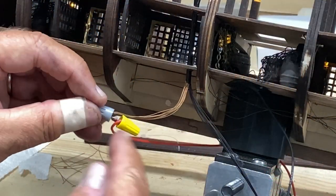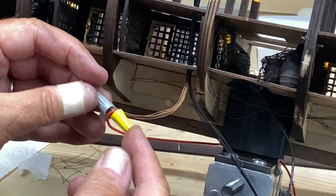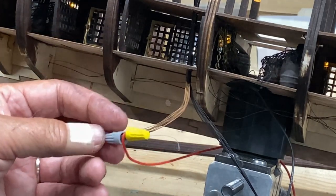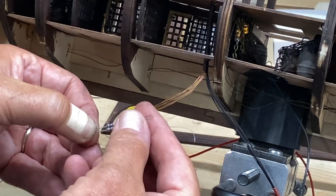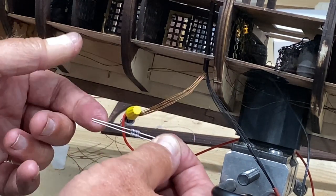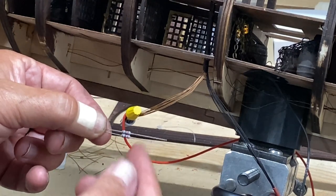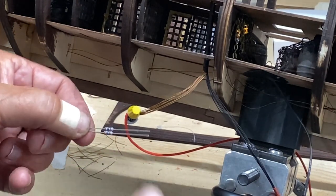The two resistors are inside here - I put those on to give extra protection to the connection. I soldered the wires to the leads on the resistors. The brown wires come out of the ship to the two resistor leads, and then the other two leads go to the red wire which goes to the positive power source. The black wires all go to the negative.